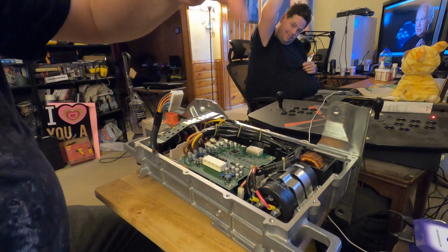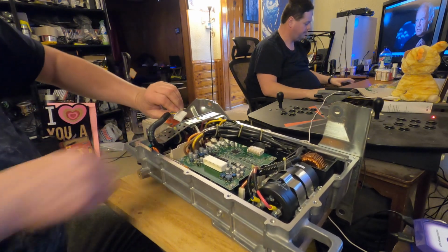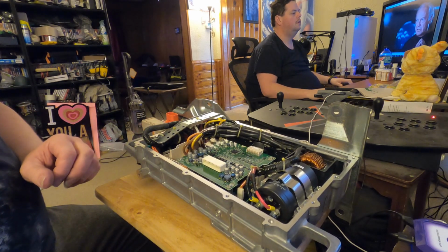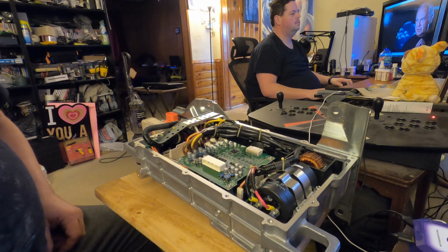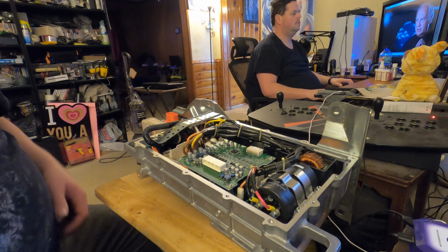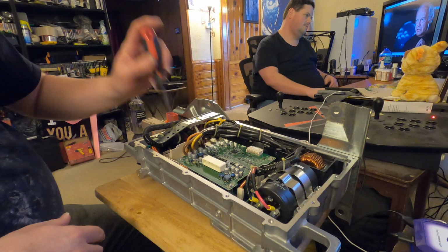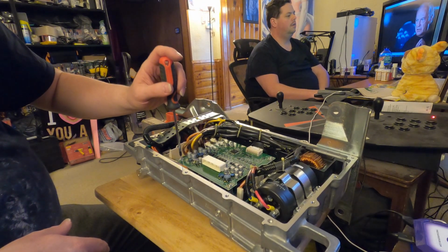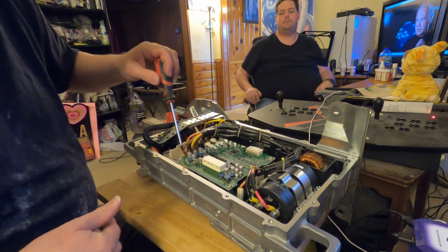But more on this capacitor while I'm thinking about it. When you start to dig into this car's high voltage electrics, there is a step in there that states when you are beginning tearing into this that you are to wait 10 minutes after unplugging the battery to let the car discharge. This is why. This will bite you, and it will bite you hard. It'll look like the Christmas tree.